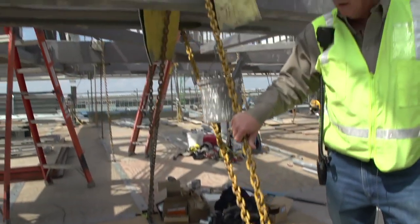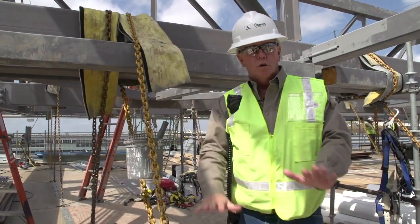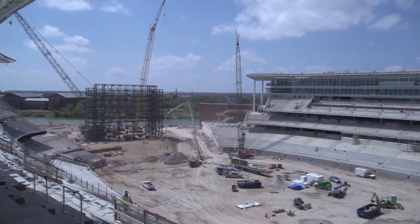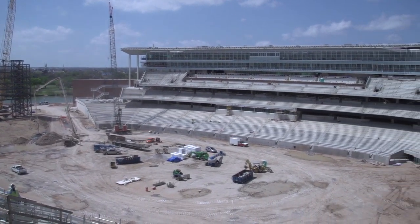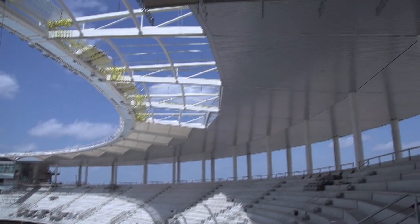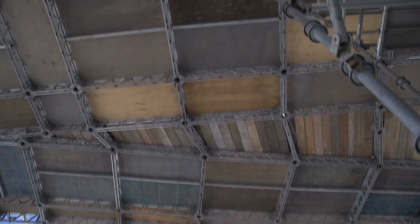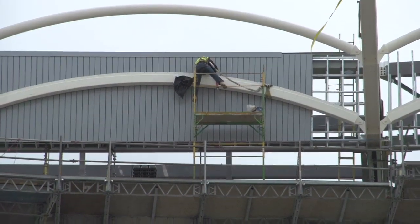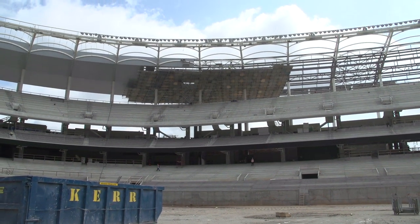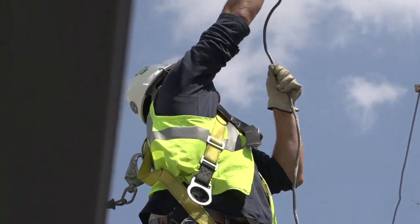One of the advantages of the quick deck is that it's self-supporting off the structural steel. What that helped on this project was there's a tremendous amount of work on the levels below it. It helped with the process of not having to scaffold up from the third deck or the roofs of all the other work from down below, and not having to leapfrog that scaffold as we go. That freed up all the concessions, restrooms, and flooring systems — the schedule could not have been completed as done without this quick deck.